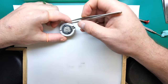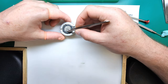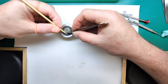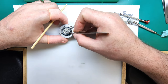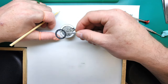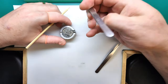There are a couple of parts we can lift off here. One is the quickset date jumper, and over here there's a spring under slight tension. You'll need a piece of pegwood to hold the tension as you lift off this little spring — if you don't remove the tension it tends to spring off into the distance. Now we can remove the date disk. The next thing is to release the tension on this spring here.